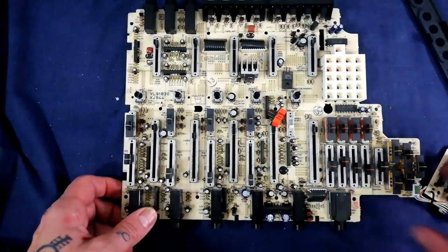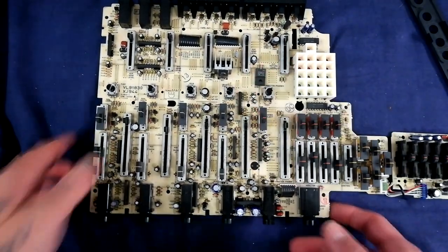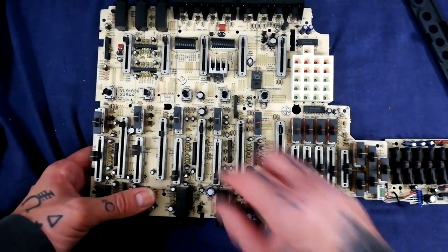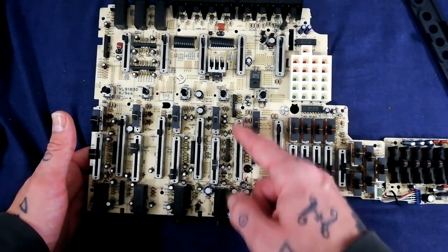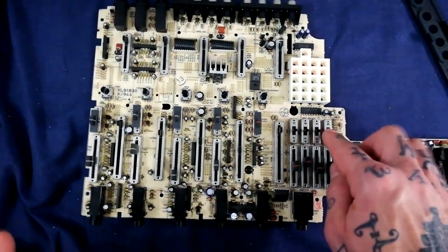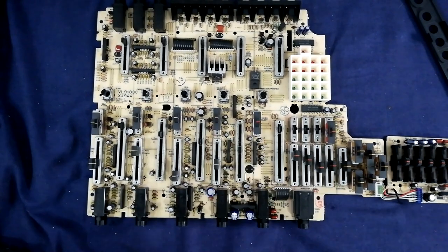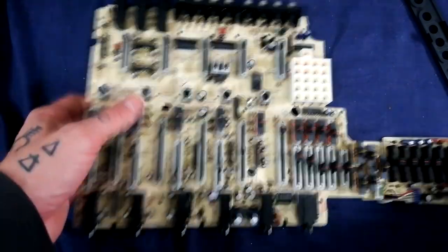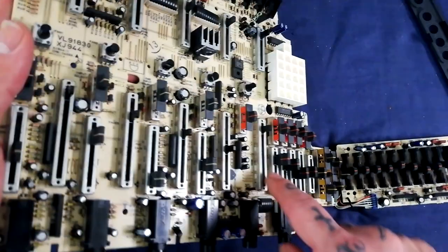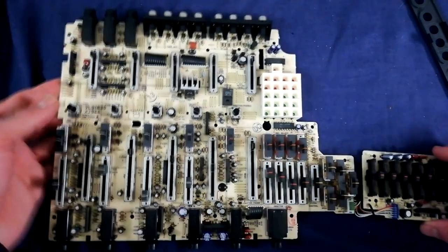At this point we've got access to the mixer board and the graphic EQ board for cleaning. I'll be using some combination of contact cleaner, compressed air, and finishing off with lubricant - I've got several detailed cleaning videos on other models on my channel. A lot of these caps are going to come off the switches - for these types of switches it's easier to clean with the caps off. Caps will also come off the faders though it's not strictly necessary to remove them. The graphic EQ sliders are the same principle as the faders but without a metal casing, so they're actually easier to clean.